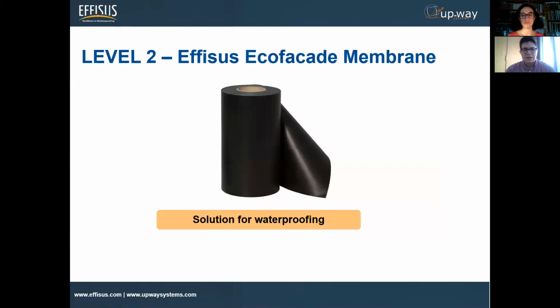This membrane comes in different widths, and the exact dimension you need will be for that joint itself. We supply it for the specific application, in the quantity you need. The rolls, I think, are 20 meters long. Depending on the development of the gutter, this can fit multiple applications. You don't have to worry about all of this. From the client side, all we need to know is the quantity of connections you have and the total development, meaning the whole gutter development.